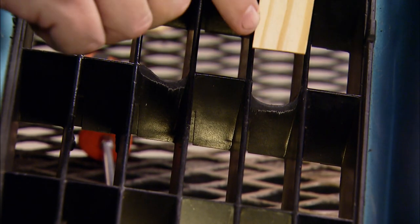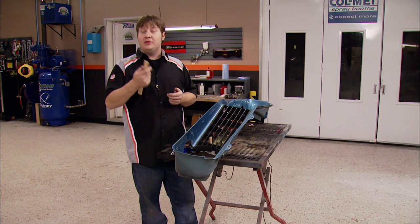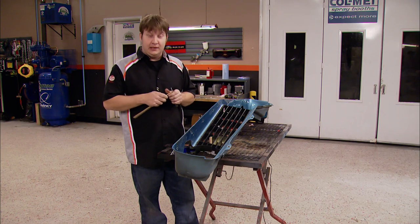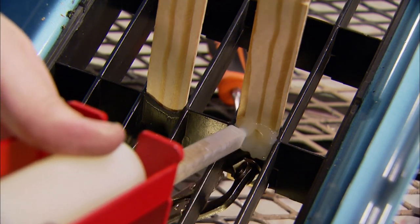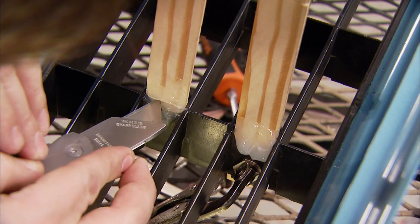By adding a taper, whenever I put my filler in there it broadens the surface — instead of just being right on the edge, it's actually down past it a bit. Now I need to build a form so that whenever I put this stuff in there it won't just flop over. So I'm going to take this paint paddle, trim it down a bit, and see if that'll work. Before you start applying the epoxy onto your repair, it's a good idea to squirt out a decent amount to ensure that the stuff is mixed properly.